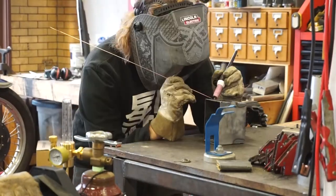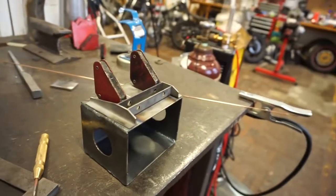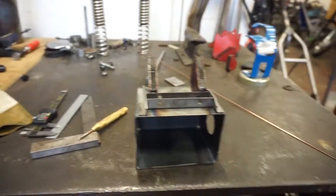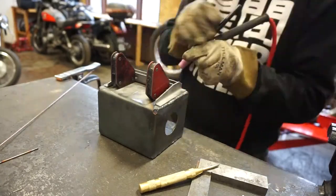I was having a bit of trouble getting these welds to sit nicely, despite grinding and sandblasting and cleaning with both solvent and acetone. Still was fighting a little porosity, so off camera, I ground some weld out, rewelded it. It took a while, but we're done. And now I've got all of my smaller top pieces fitted up. Warped a little bit with the heat of all the reweld, but everything is more or less square, and I'm gonna glue these little bits on top.